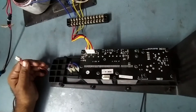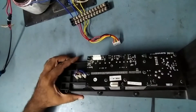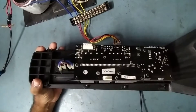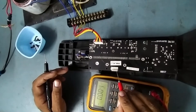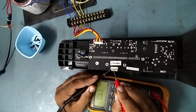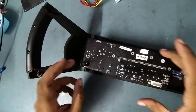We'll check why the mid is not working. We'll disconnect everything now. I'm getting some voltage here — 47 volts DC. Actually, it should not be here. This is the speaker connection and it's giving output voltage, which should not be the case. The HF coil connection shows no voltage. We'll check why this voltage is coming here — it should not come.